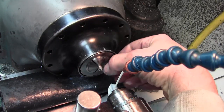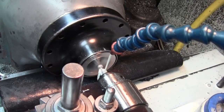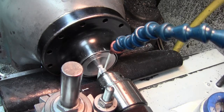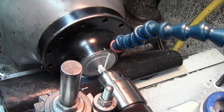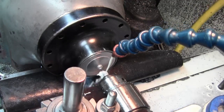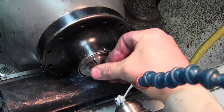And you'll notice, I didn't even worry about taking the tit off from the parting because that comes off in this operation. This is part of the drilling, so save a step of facing these to length or whatever. Length on these isn't critical, so there's no point in getting all wacky with a turning tool to face these off to length.